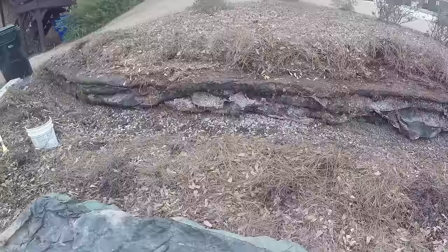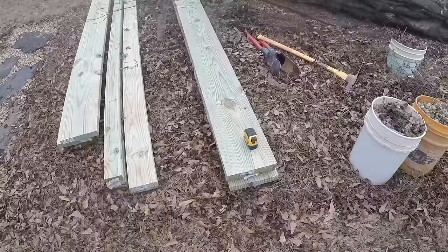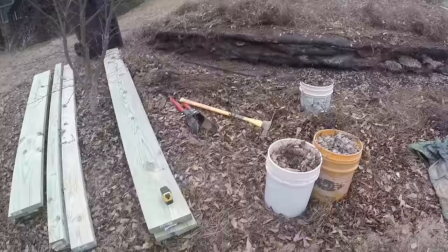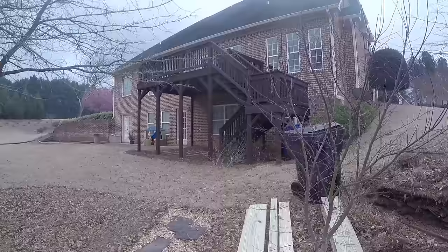It's not really load bearing, but you can see where the wall used to be. I have recovered as much gravel as possible from the previous retainer wall and I will be replacing it with 2x10s supported by 2x6s, and some 2x10x8s and 2x10x12s for the various lengths that I have. This is ground contact rated lumber, meaning it's not just pressure treated but it is rated for ground contact so it can be directly against the dirt. They say it lasts up to 30 years — I give it more like 10 years, but it does work a lot better than what you would typically build your deck with.